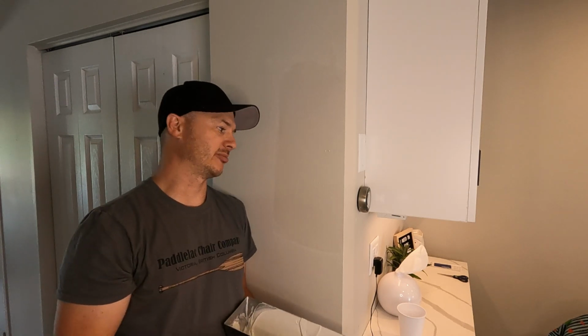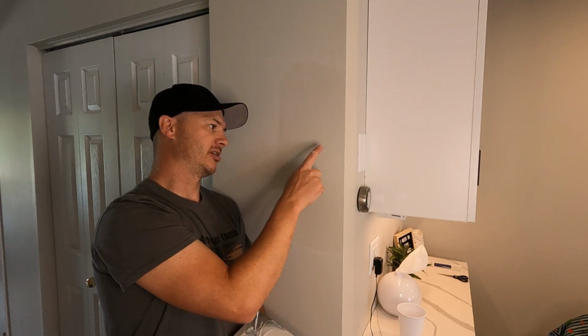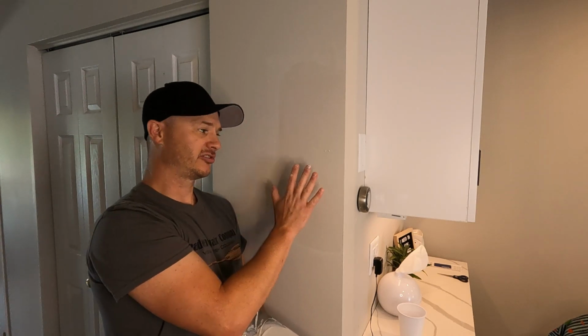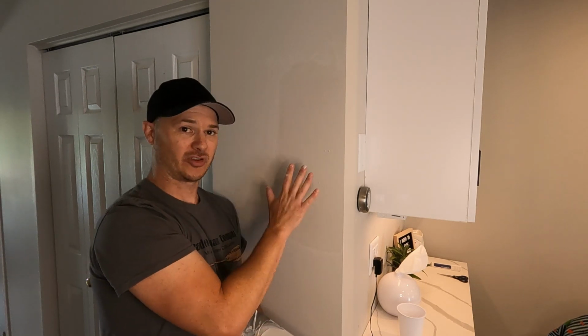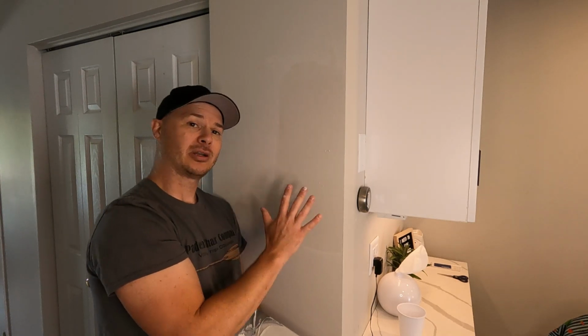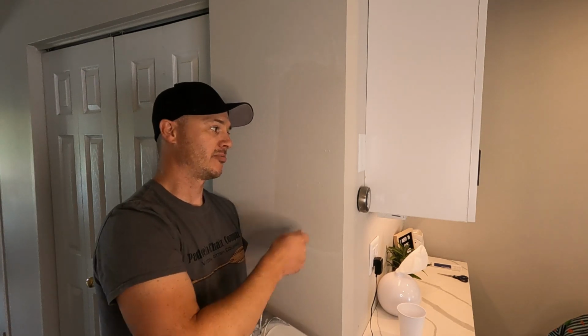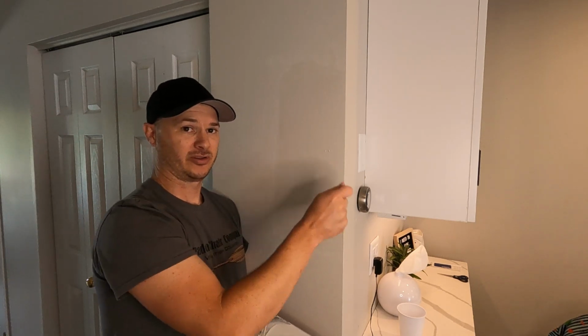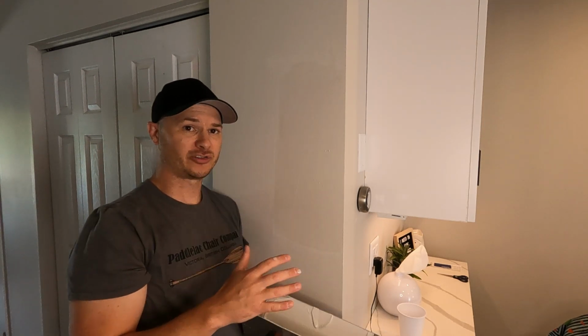But again, we're trying to do a quick patch, so we're kind of pushing the limits. And sometimes when you push the limits, it ends up costing you more time. So in this case, we're pretty good. We've got a nice even coat. In here, we're getting some fish eyes. So that means it's a little bit thicker in that area, and it's nice and thin on the outside. So this coat would probably be okay if I didn't have these bubbles. Some of them might actually go away a little bit. We're gonna let this dry, see what it looks like. We're gonna come back in a little bit, keep our eye on it. We might be able to work these fish eyes, these little holes back in, and it might be okay, and we might just be able to get it with some spackling, or we just do another thin coat.